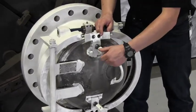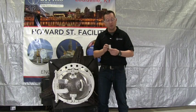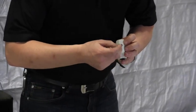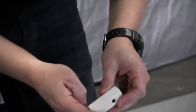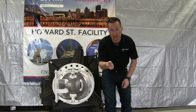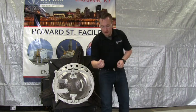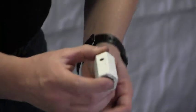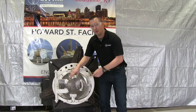Start the inspection with the PWD — make sure it's opened all the way up. On the inside there is a gasket that needs to be inspected and periodically changed. You can use a small piece of wire, go into the holes at the very top, push the gasket out and down, and slowly work it out from the bottom. If the gasket is damaged, replace it before reassembling. To install a new gasket, simply place it inside the PWD all the way to the bottom, then place the PWD back on the nipple.